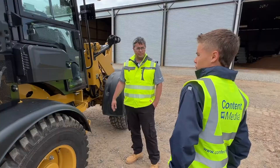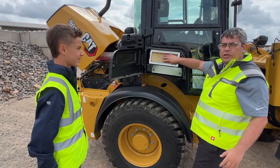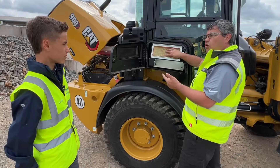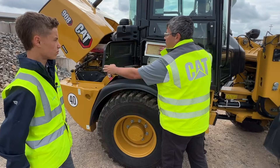So Elias, is this the air con filter? Yes, if I open up in here we've got the air conditioning inside, which is now improved by about 60% higher efficiency. We've got the air intake filter and we've got a recirculation filter in here. These filters are replaceable with either charcoal or a MERV 16, which is a high filtration level, for different applications and different industries. So you've really got a lot of air coming in to blow through all the vents inside.